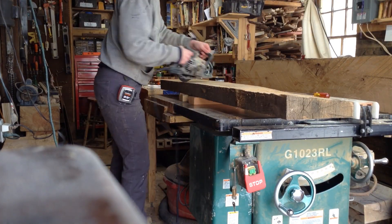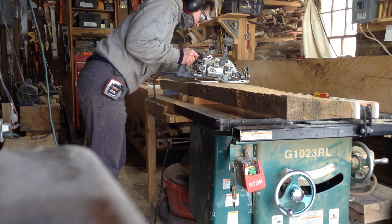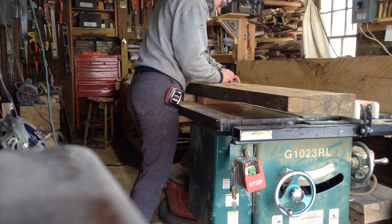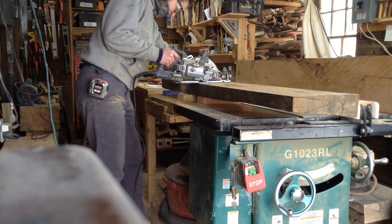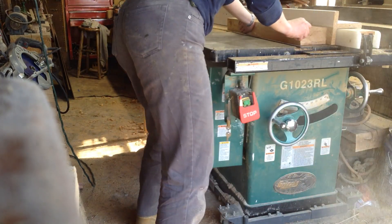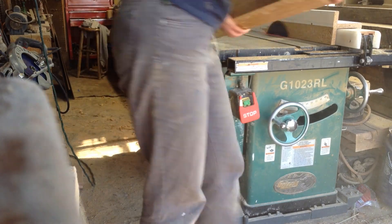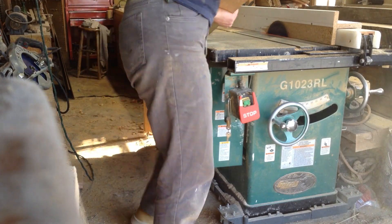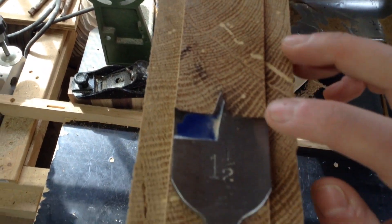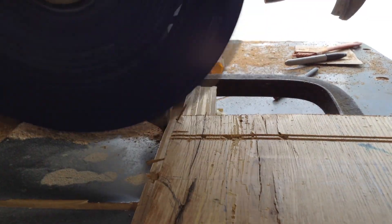These are the two main chunks I'll be working with to make all the top pieces of the trestle as well as the middle sections. I'm cutting the middle portions first, and then I'll need four tops and four bottoms. With the material I had, I couldn't get as tall as I wanted — it was about two inches short of the ideal height, even with the top added. So you'll see later that I do add a piece to the bottom of the trestle, which actually ended up looking pretty nice. For the tops and bottoms, I'm using my jointing jig to get straight edges — sending it through a couple of times and referencing it off a piece of melamine to make sure it's straight.